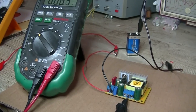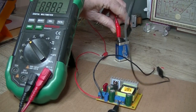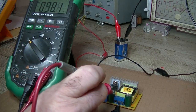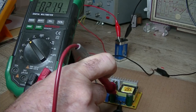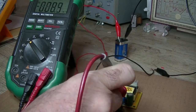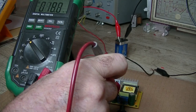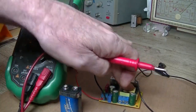I've got myself a 9-volt battery. I've got the negative hooked up, and now we'll just get that positive on there. I don't know if you can see it - the little green LED lights come on. Let's see what sort of voltage we get out of it. 21 millivolts. And on the negative side, negative 39, 40 millivolts. Well, that's not good. The description said default is 10 volts - let's have a look at this battery: 8.8 volts, almost 9.